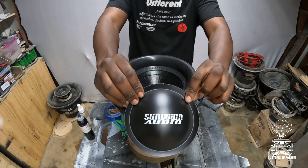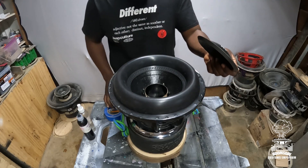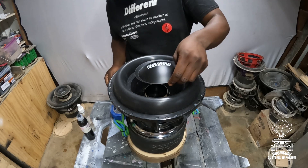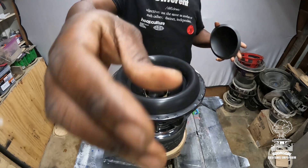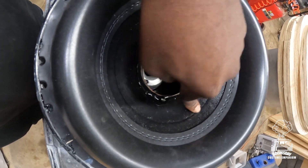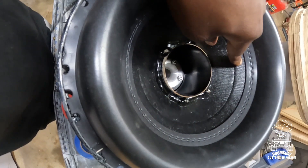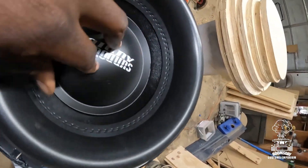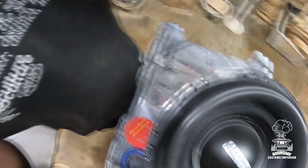Now I'm going to show you how to put on the dust cap — it's real easy, don't feel intimidated. First, take your dust cap and line it up on your sub where it's going to go. Some sub cones have little ridges where the dust cap sits. This is a Sundown ZV5 12 cap and it fits right in that little groove. If you're using a custom cap without a line, take a pencil and trace around the outside edge of where the dust cap is going to sit — that tells you exactly where to put your glue.